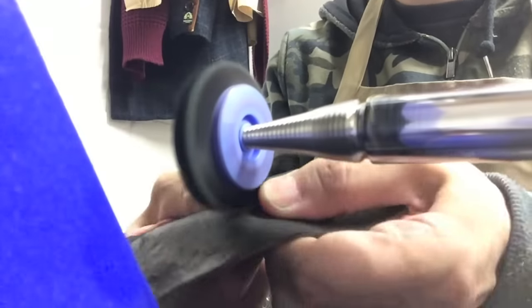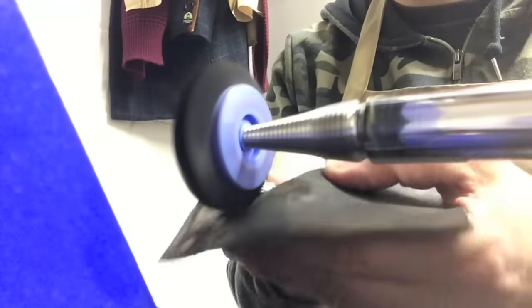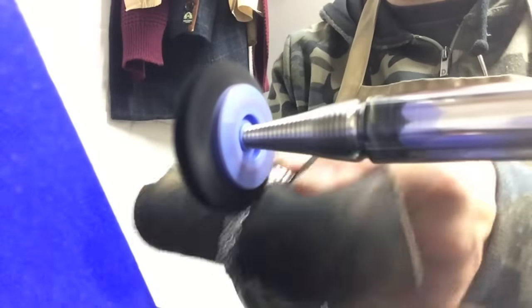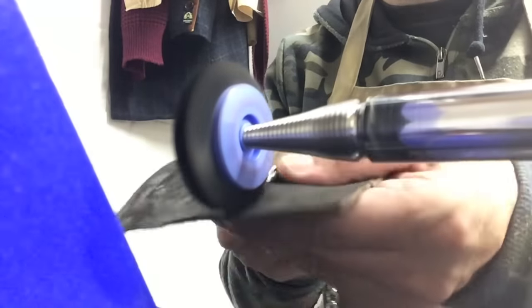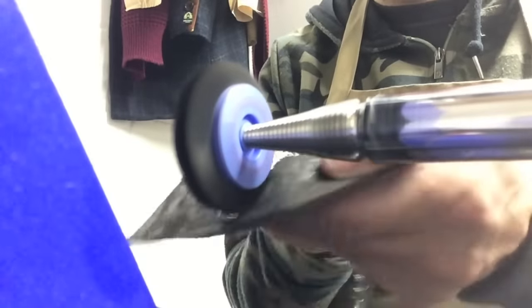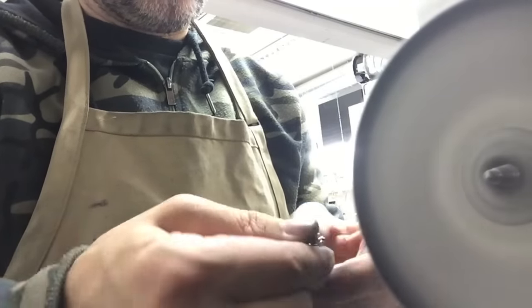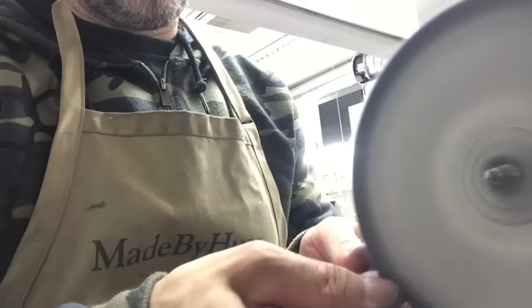It's also a good idea to put your bracelet through a pin barrel before polishing it. Notice I'm polishing it with a brush. I'm holding the back, I'm not letting it dangle. I don't want the machine to grab the bracelet. Again, especially with the mop, hold your bracelet with two hands, don't let it dangle.